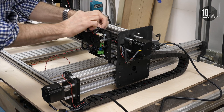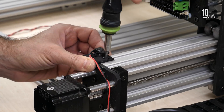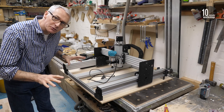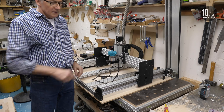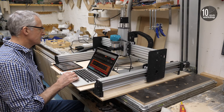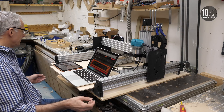It's fortunate that it's the X-axis limit switch that's problematic as the cable is relatively accessible and the change is easily made. With that done, I'm also taking the opportunity to swap out the mounting plate for the Y-axis limit switch for the new version, then twisting the machine around to face front again. This is kind of second moment of truth time - that one lights up. Fingers crossed when I get the software up and running. The X - this is the one that was problematic - zooming home.